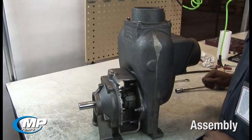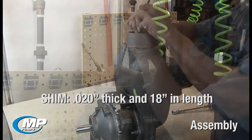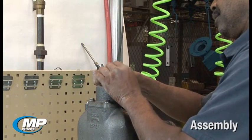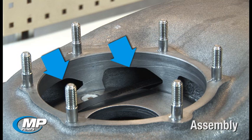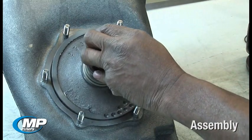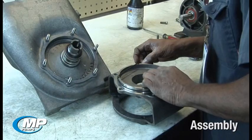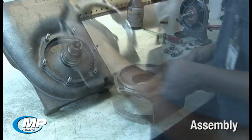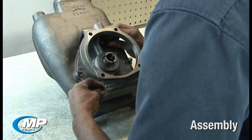If the pump came pre-assembled to a drive unit, then a piece of shim material will be needed. Shim material should be approximately 20 thousandths of an inch thick and 18 inches in length. Looking into the discharge port of the Flowmax pump, you will see three holes in the housing — one to the far right will be a small round cast hole, and the other two are finished machined rectangular slots. The middle hole or slot is where the shim material should be positioned. Place the impeller and drive sleeve assembly into the pump housing, install the housing gasket, install the adapter o-ring if you have a newer model Flowmax, and install the adapter onto the housing using care to orient the adapter correctly, tightening the six hex head bolts or nuts.